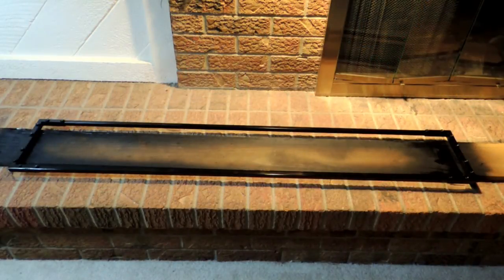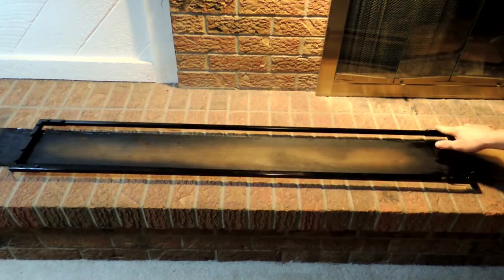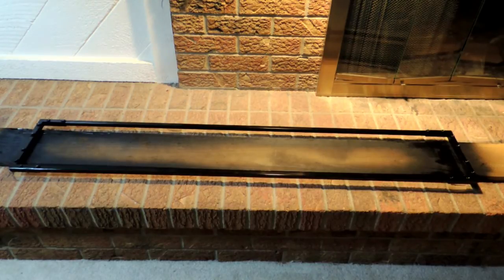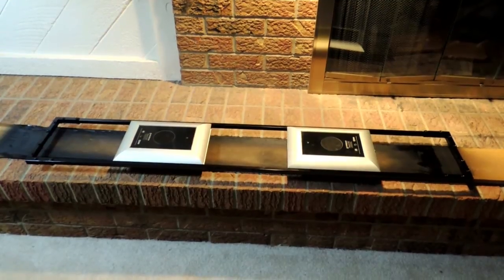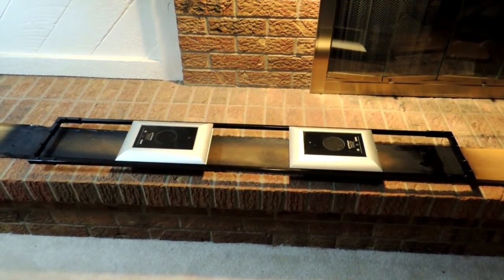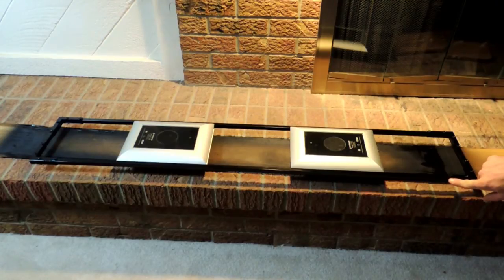Here it is completely painted up. There are about three coats of the epoxy appliance paint on here. What I have to do now is take these four bolts off, then I can slide the lights in. I'm assuming when I pull those bolts off I'm going to chip the paint. So I'll go ahead and slide the lights back in. There it is — the lights are installed. I'm going to go ahead and silicone up these ends that hold it and run a bead along each of these sides to make sure water doesn't get in any of this. Then it's ready to go on the tank.